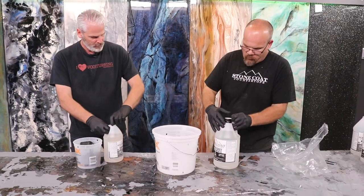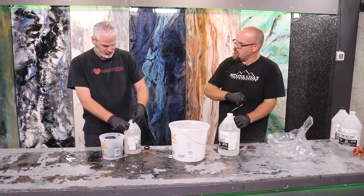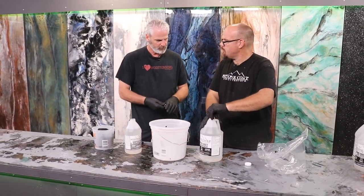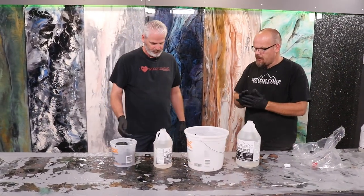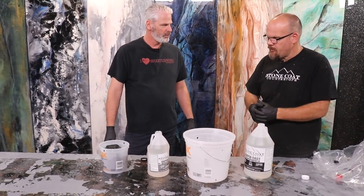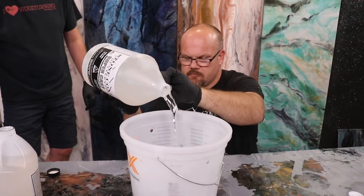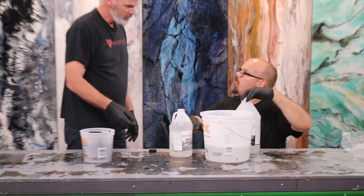It also can be poured where you can't get into a crack and crevice. We don't mix this with a drill. We mix this by hand so we don't entrain a bunch of air, so you won't have a lot of air bubbles. We've poured really thick, and it doesn't generate a lot of bubbles that you're fighting. It torches out really good. Typically we'll torch every 1/4 inch as we're pouring a big mass, and it lets the bubbles come out. If there was a stubborn big bubble at the bottom, I could heat up the tip of a Phillips screwdriver and get in there and pop it. And because you're not pouring this on a counter, it doesn't have to retain thickness.